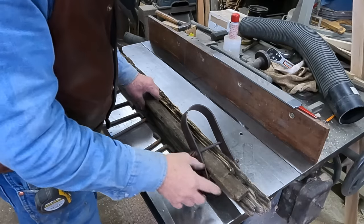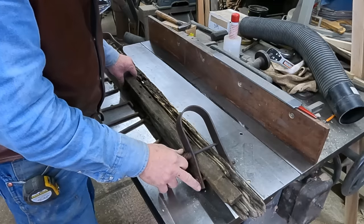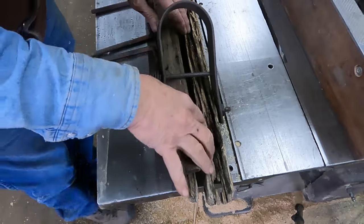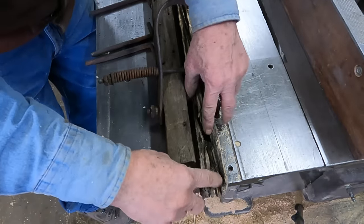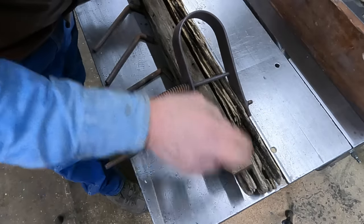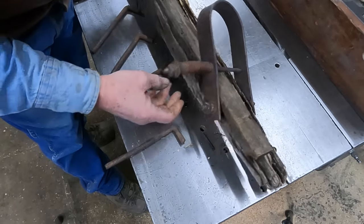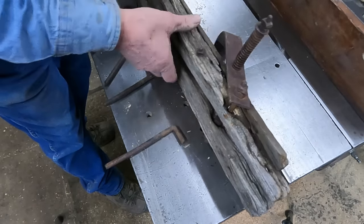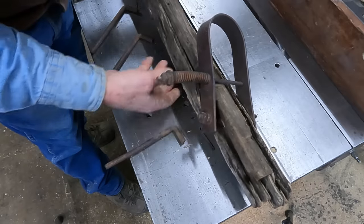So this is the apparatus that sets on those two irons that I just put on each side of the rear that hover over the top of the beater. This piece of wood here is what I just fastened to those irons, and these are the two holes that bolt to that iron. So there's a second bar that's parallel to this bar that is bolted to these two irons that we just looked at. And these are actually connected by this kind of a U-shaped clevis type iron, spring-loaded.